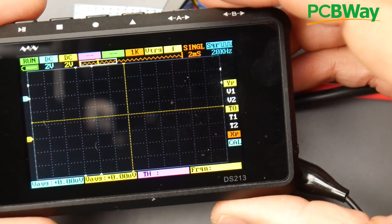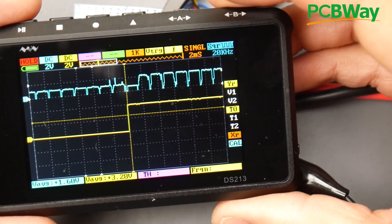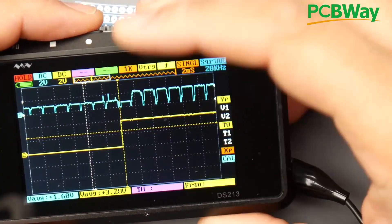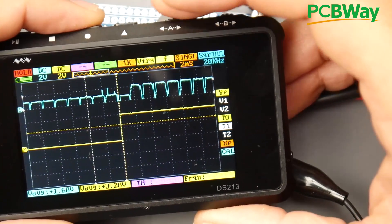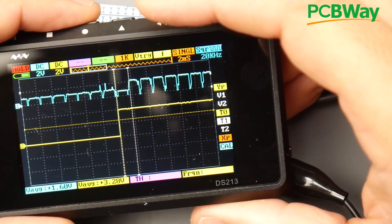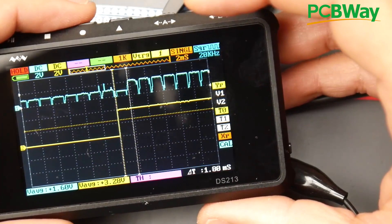We go to single mode to take a single sample. It's not always perfectly accurate and sometimes takes a while. We got our first sample. On my big oscilloscope I was getting anywhere between 1.3 and 2 milliseconds on this camera. Now I'll enable the time cursor — Time 1 — and move it to right where the LED turned on. Then I enable Time 2 and align it to where the LED registered in the video feed. Scrolling down to read the measurement — this sample shows 1.8 milliseconds of latency.